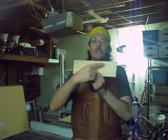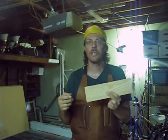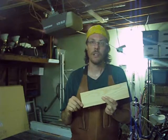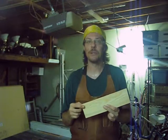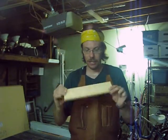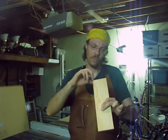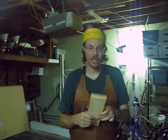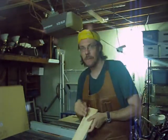The next step is to plow a little groove along the edge of all the drawer stock for the sides and fronts. That's going to receive the bottom panel, which is 5/32 plywood. Always check the thickness of any plywood you're using because it tends to be a little smaller than what they quote. I'll just do that on the table saw. It should be about a quarter inch deep, maybe 3/16 from the bottom — that's personal preference, but it should work fine for this kind of drawer.